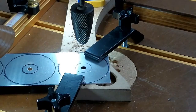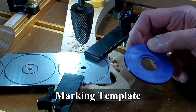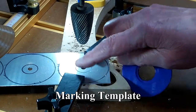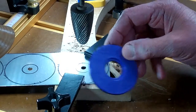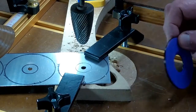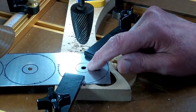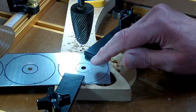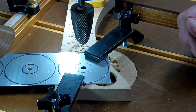I'm trying to make some fins for the Huxtable hot air engine. This is .025 aluminum sheet, and I made a template on the 3D printer. You use a sharpie to mark the outside and inside diameter, and this makes the hole a bit too small and the outside diameter a bit too large. I don't have a way of drilling this accurately, so I have a starter hole, and I'm going to use a rotary file to grind that out, and then fine-tune it with a rotary stone.